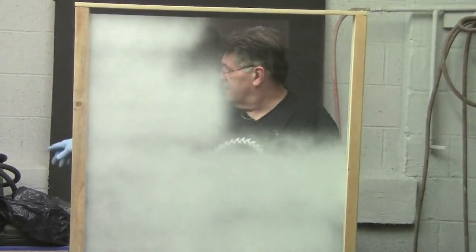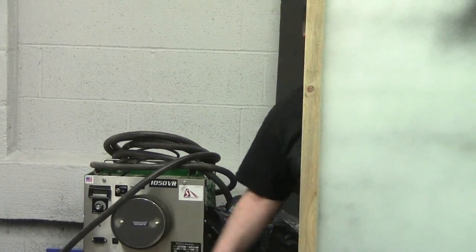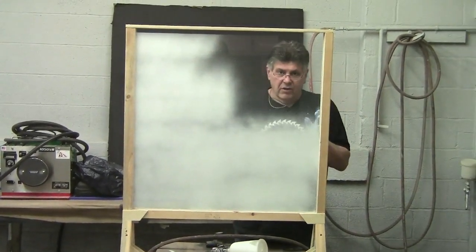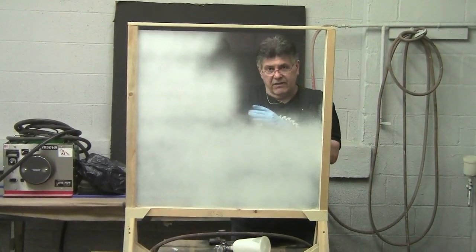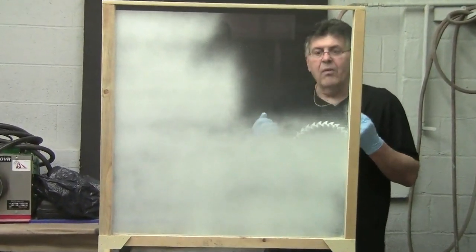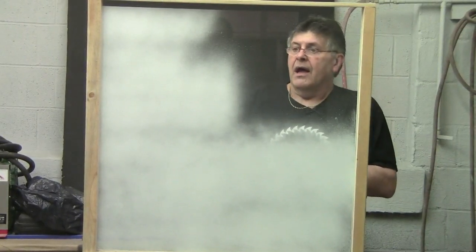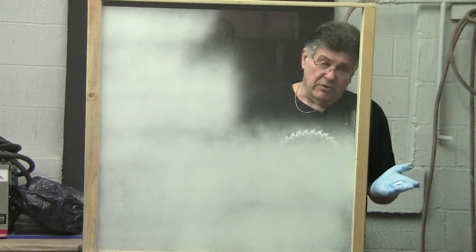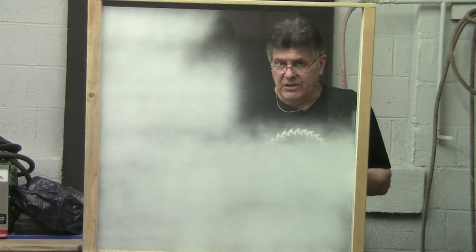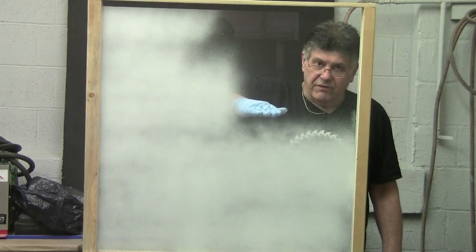In the case of a turbine like this one, it has a variable pressure, and we're going to look at that when we compare turbine stages. But the whole key here is how well we atomize it. The finer we can lay that film on, the smoother it's going to be. Atomization — break it up. If you can't increase the pressure, reduce the fluid.